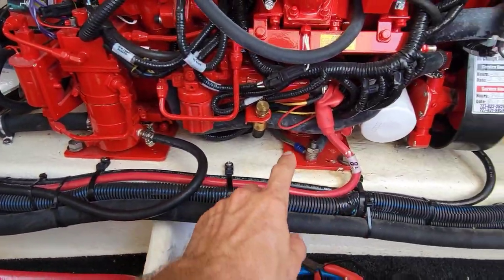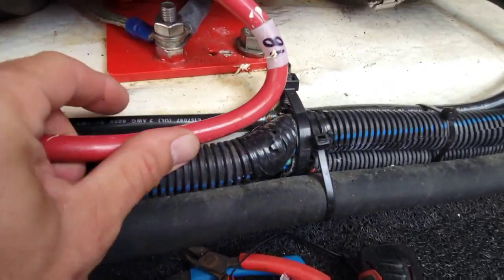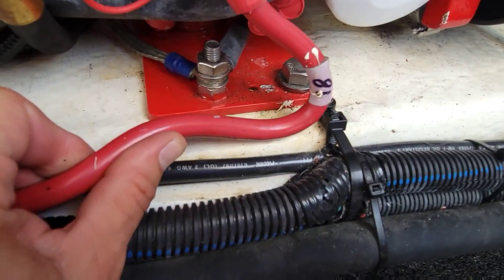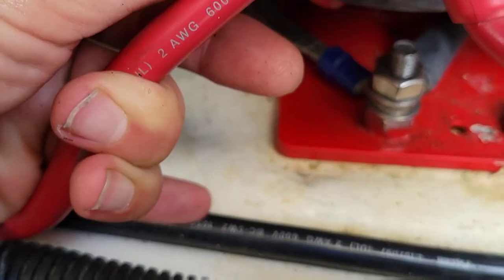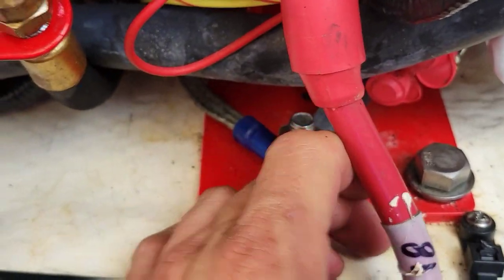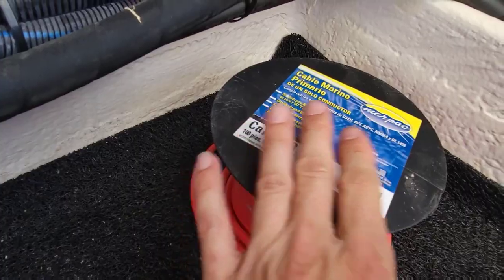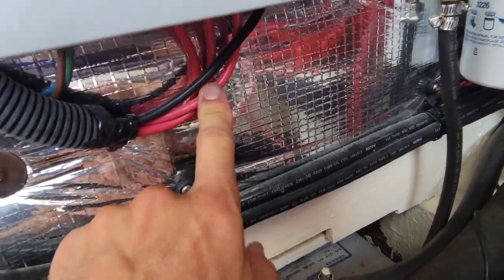Unfortunately the cable I pulled out isn't going to be long enough, so I'm going to go get some wire and remake this cable. Four gauge is way more than sufficient - looks like they've got bigger gauge here, actually two gauge. So I'll use four gauge; it's a little bit smaller, makes it easier to work with, and it's not going to change anything since the generator doesn't draw much power starting. We got our wire here for the charge relay - we'll run this over from the battery; eight gauge is more than sufficient. The sun's shining right down into the hole now - feels like an oven in there. I'll do one step at a time and show you as I go.